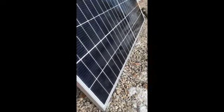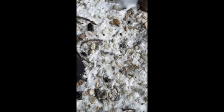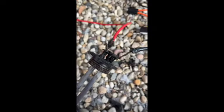All right. Here we are with blender number 1, learning the temperature limitations of the components. All this black stuff is the plastic molding at the top of the elements. That used to be a nice, beautiful little box up on top containing everything, where the screws would screw into. So clearly this element is toast. It was just running at 268 degrees Celsius.